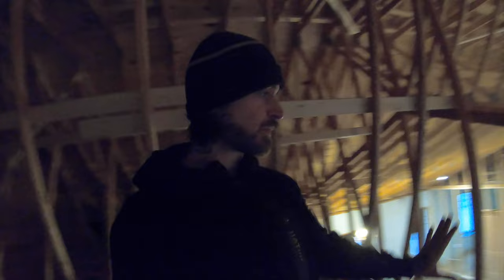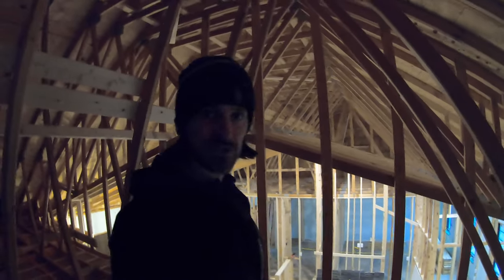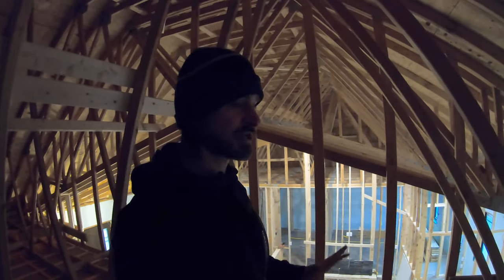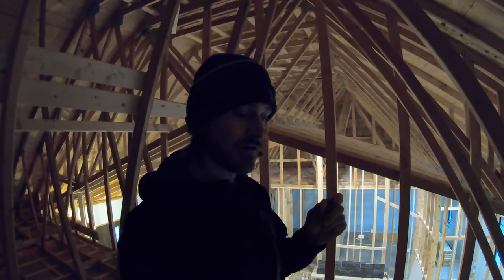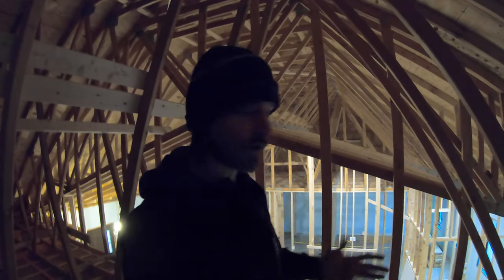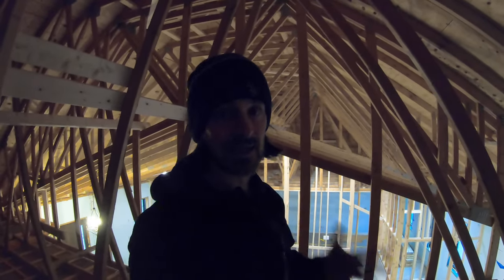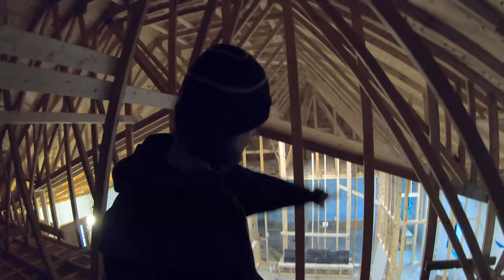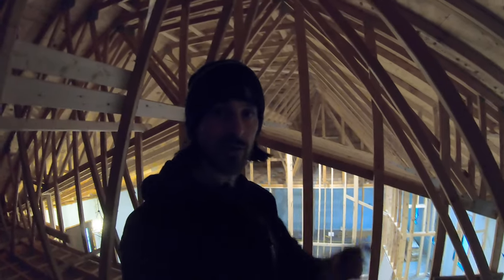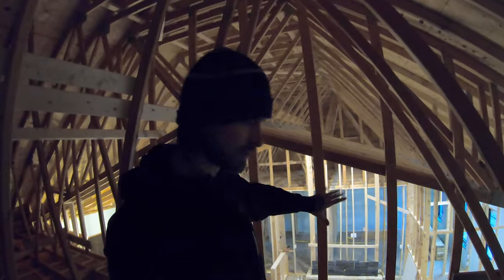I think the one that we ended up on is once we have the drywall hung on the outside and we spray foam down along that 2x4 and stuff, I think the best suggestion is probably to get an inch and a half of like pink foam or any type of foam. And then in each one of those spaces right there, we can do basically like a cutout of insulation. So we can stick it up against there, spray foam the edges, so that way you've got an inch and a half of like pink rigid foam stuck to the back of the drywall.